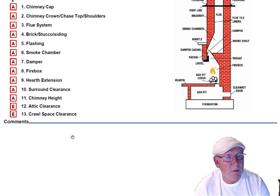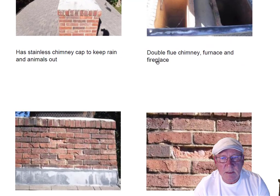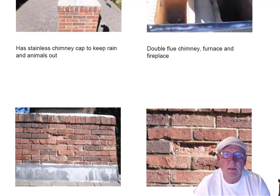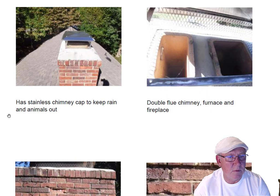If I had some negative comments I would put them here. The only thing we can see — and it's not really a negative — is we've got two bricks: a full face brick and a little corner brick where the faces have deteriorated a bit. What happens is moisture apparently got in behind there and during freezing temperatures popped the face off. There's no further deterioration and it looks like someone has put sealer on both of those bricks, so I don't think it's anything for you to be concerned about. I didn't include it in the notes as something that needs to be repaired.